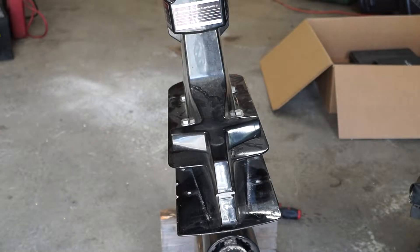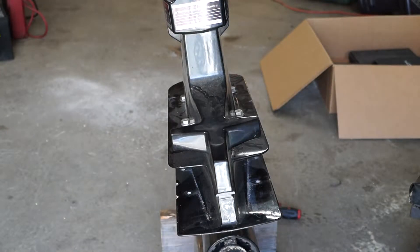What's up everybody, main boat guy back again. We're going to be pulling this SEI Alpha One apart. I did a pressure test and I've got a couple leaks — one I believe is below the water pump, and the other one I saw is the shift shaft seal on the back. Let me see if I can show you.